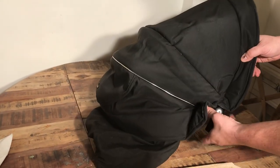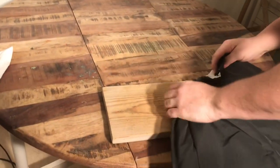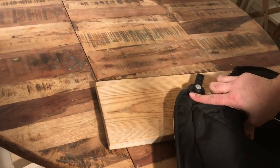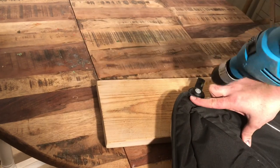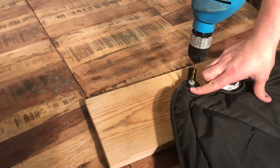In order to disassemble this canopy, you're going to need to drill out the rivet on the side here. You're going to want to use a table because the rivet needs to be drilled from the outside, and you've got to hang the rest of the canopy somewhere. Use a five millimeter drill bit, and it's best if you use a fresh drill bit.